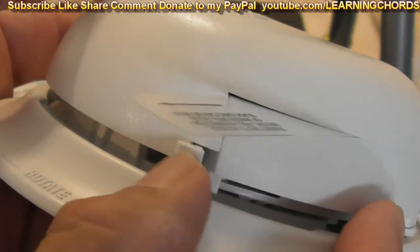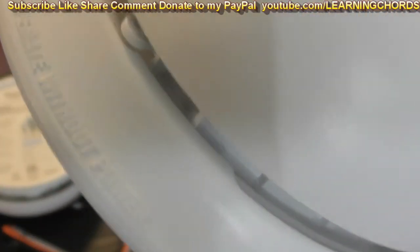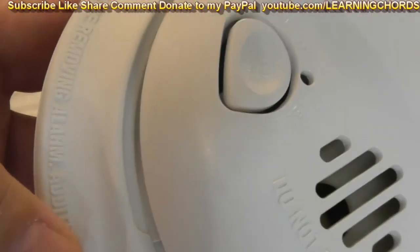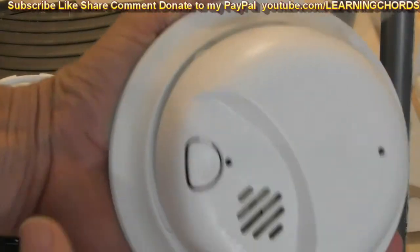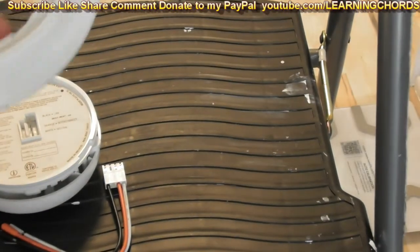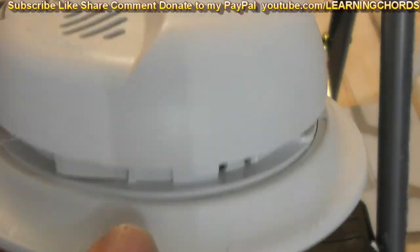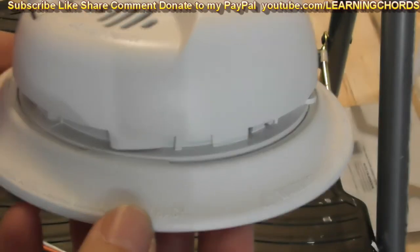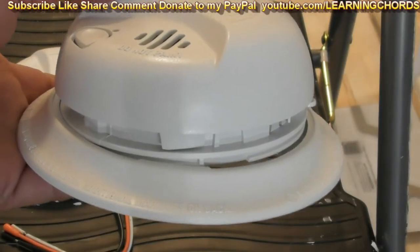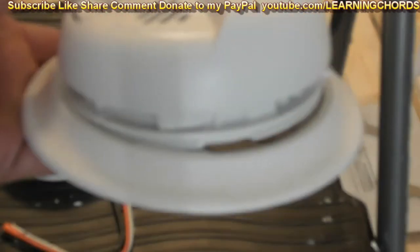There's a little door here — you slide it to the side and that's the battery door. Do not operate without power — you want both AC power and battery power. There are some models that don't have AC power. So what I had to do in the middle of the night was unscrew this thing and yank the power cord out. On the new one, I like to put the date on the base — a lot of people don't think it's attractive, but not many people look up at the ceiling to see a smoke detector, so at least you'll know when it was installed.